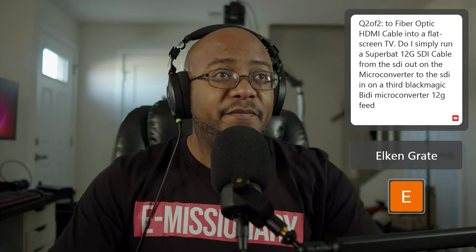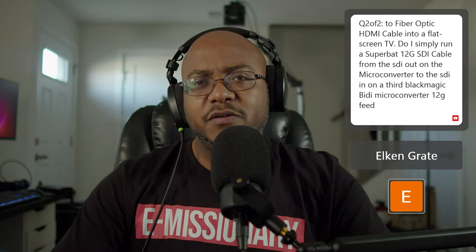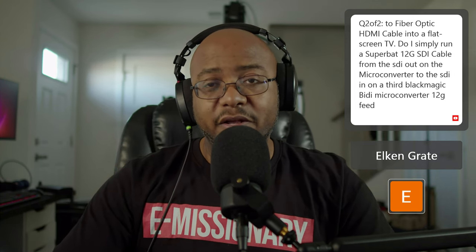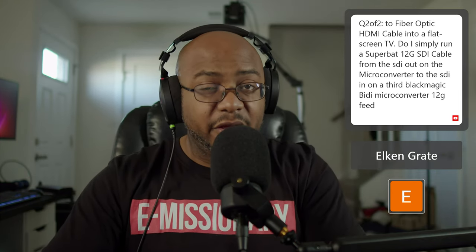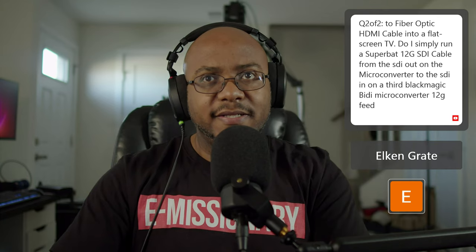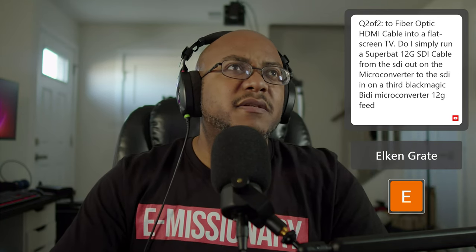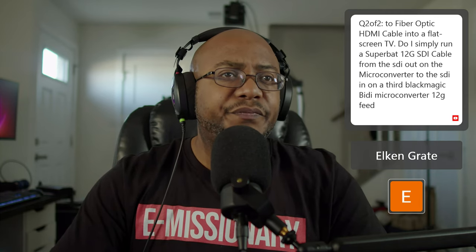That's really it. I haven't messed with the 12G. For those who don't know, the 12G is one that's capable of 4K. The 3Gs are the ones that I use that are good for 1080p. And the RG6 that I use, to my knowledge, that existing cable does not work with 12G. But that's what that is. So, yes, that's technically all you got to do to get that to work.